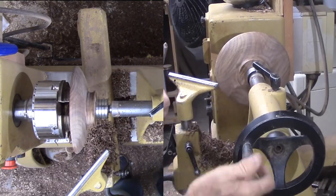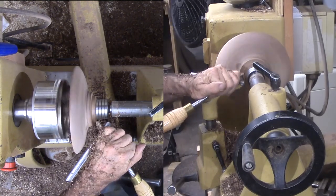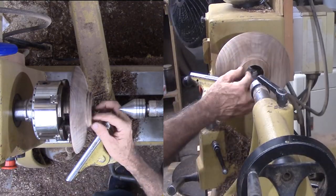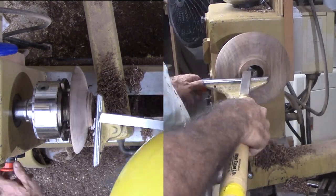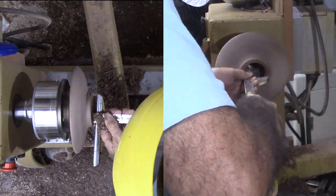The top is a bit trickier with that large hole. My cone center barely holds to do the security job. The wood is way too thick around the viewport. I have a lot to remove, and that mortise holding the top to the lathe is very shallow. This turning is a bit tense, but I keep the live center for as long as possible.